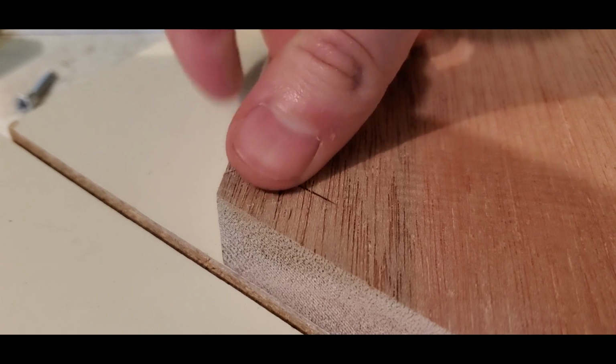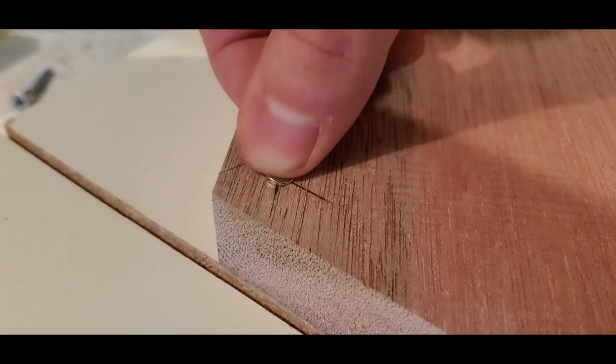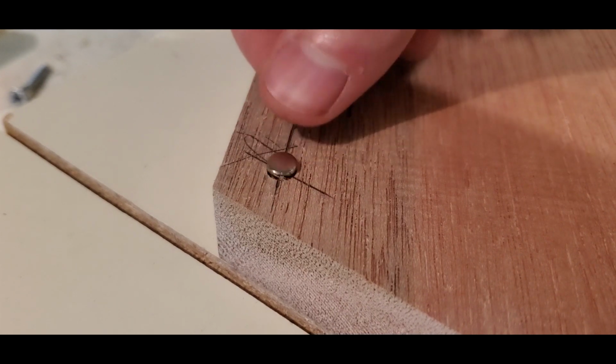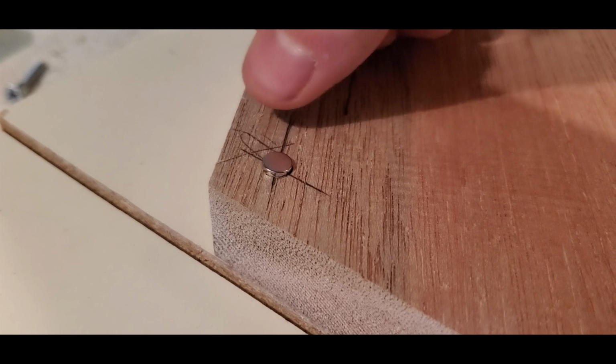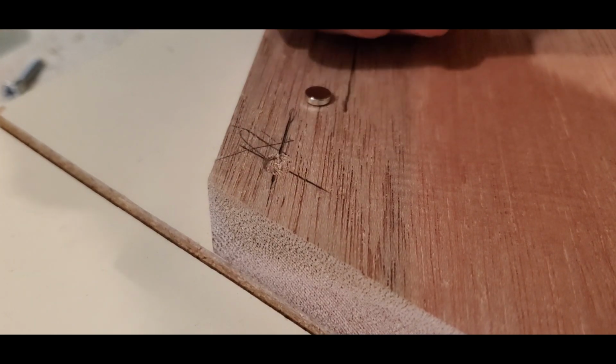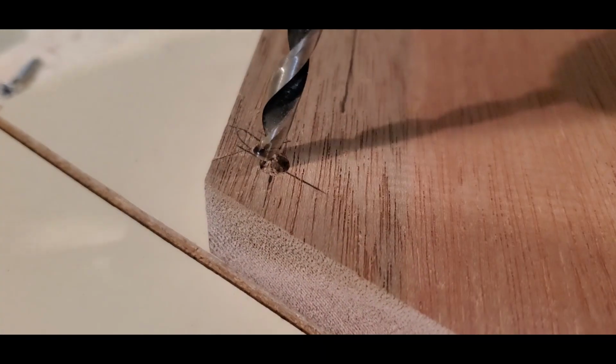Note that when we place the magnets on the bottom side, we will want to make sure the polarity of the magnet is the same as the top side. The easiest way to make sure that you have the polarity right is to simply place the magnet near your hole, and the magnet on the other side of the wood will pull the magnet to the correct side. I can honestly say I played with these things for about a good 10 minutes.